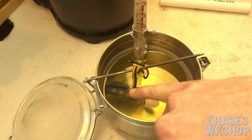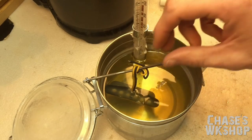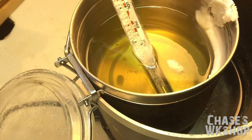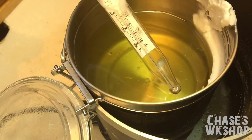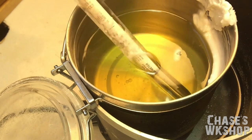You see the buildup on the back of the pickup? That's from being colder than the wax — I maybe should have gotten it a little hotter with the heater. Hopefully it'll melt off and fill in. The thing cooled down way too fast so I had to reheat — I think it's because it's so cold in my shop, and I think I shouldn't have taken it out of the water bath. Mistake learned — we're going to let it get down to 140 again and put the pickup back in. Maybe I should have preheated the pickup a little better too. I'm no expert at this, constantly learning.